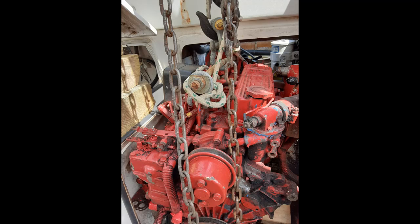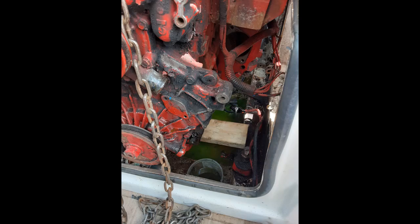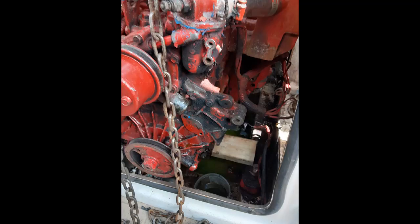One of the big revelations for me was that you can set this engine down on the oil pan and it will support it. I actually went through considerable time and effort to put blocks under it and put the engine mounts back on so it could sit on the blocks, but through this process I discovered it does sit on the oil pan. Maybe it varies by year, but mine did — it supported the weight of the engine, which made things a lot simpler. The engine supposedly weighs 275 pounds including the transmission.